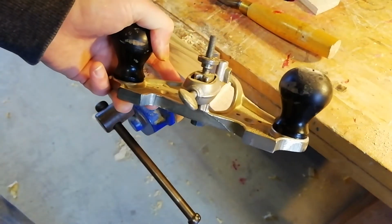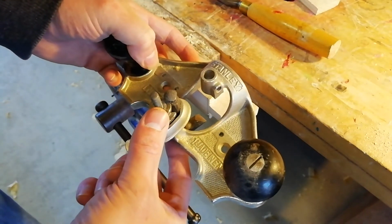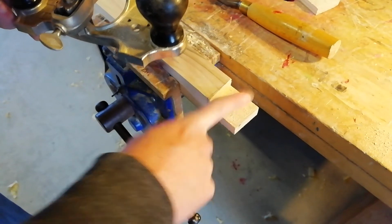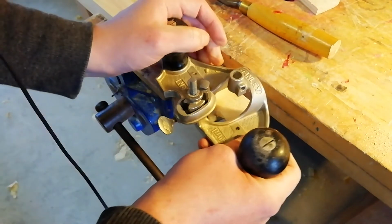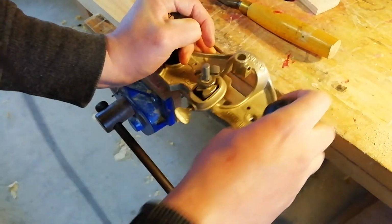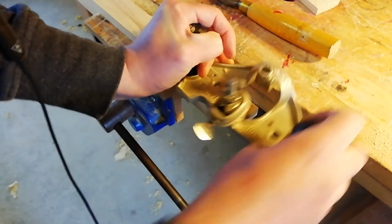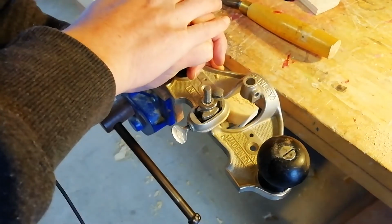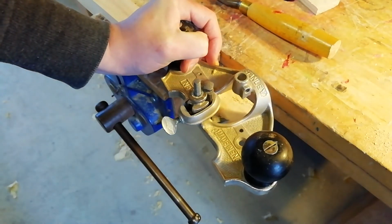It's not essential. Like I said, you can use a chisel as we did last time out, but this will allow you to set a specific height from the edge of our wood to the part of wood that we are cutting. And we can do that from either side to make sure that this stays dead center. So we want to set this up so it's barely taking any wood off, and that's pretty much where we're at just now. Okay, I'm just kind of scratching the top. I'm very much anchoring this hand to the wood because I don't want this slipping down as we're doing this.